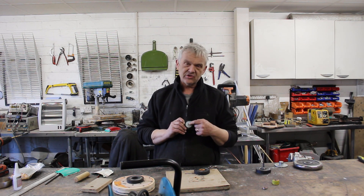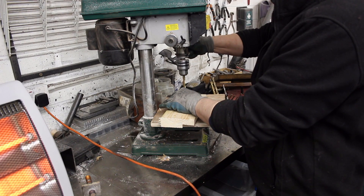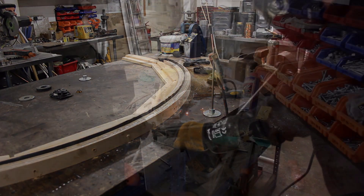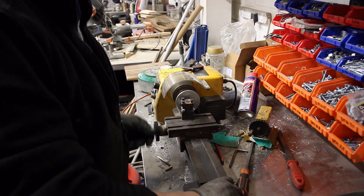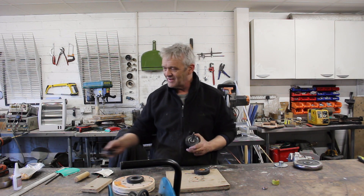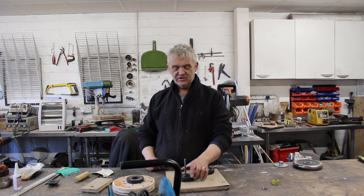Welcome to the world of TNT — let's look at speaker magnets. Speaker magnets are awesome and really well engineered. At the back you'll see a dimple — that's the center. If you drill through that dimple you'll get a central hole. If you remove the cone and knock off the top bit of metal, leaving the base plate on, then drill through and stick an 8mm bar in, what you get is a centered, stable bar with a magnet on it — all centered and square, really easy to achieve.